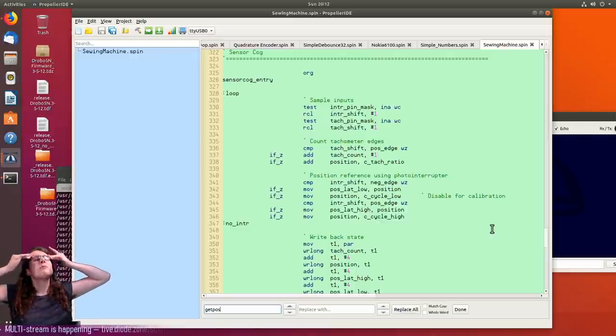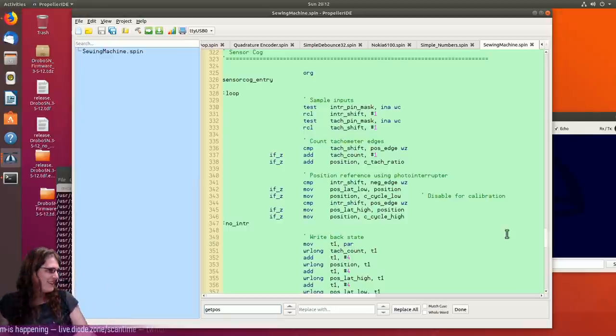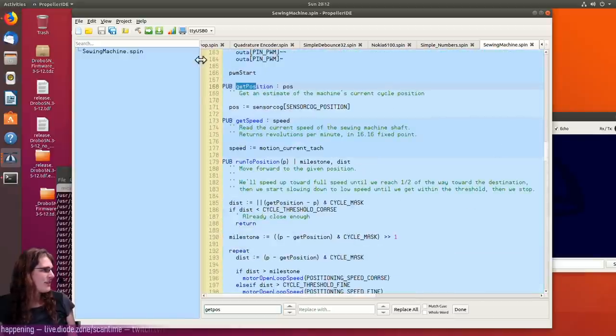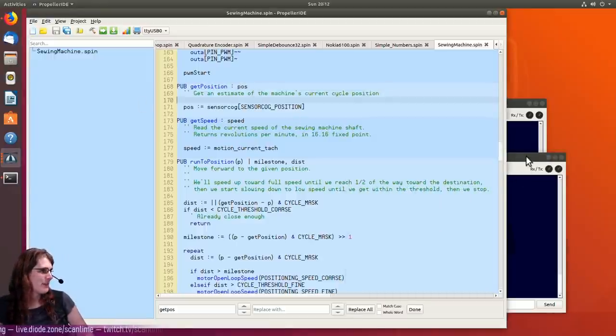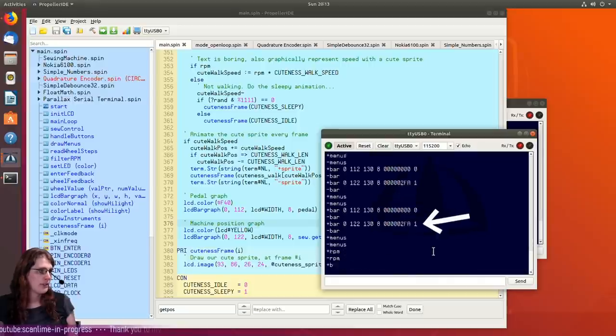I think this happens in bobbin winder mode because we're not getting our zero. So I think the position estimate might just wrap around past 360 degrees. That's funny. Yeah, well, let's just run this again to see if we can get some more evidence to support this, but I think we're just going to need to AND this with FFFF and be done with it. What a silly bug. So now we've got the input in hex and then the scaled value in pixels.